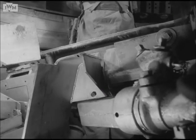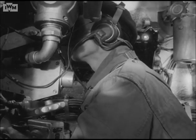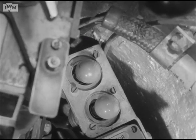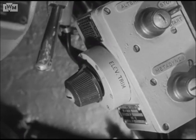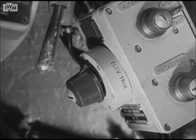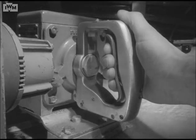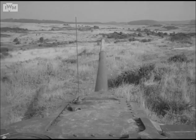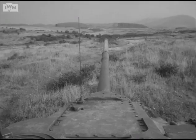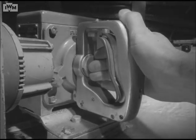The gun is now on power and stabilized in elevation whilst the tank is moving. Since the stabilizer has nothing to do with shooting, the gunner has no control over the gun in elevation until the tank stops. The upper warning light tells the gunner the main armament is loaded and ready to fire, and the lower that the tank is traveling without the stabilizer system operating. The knob at the side trims out any tendency for the gun to creep when controlled by the stabilizer. On pressing the grip switch of the power traverse controller, the hand traverse is disconnected and the turret will traverse in the required direction. Speed of traverse will increase as the controller is inclined from the vertical. Slow speed is quite smooth enough for fine adjustments to be made onto a target. Releasing the grip switch makes this control non-effective and puts the hand traverse control into engagement.